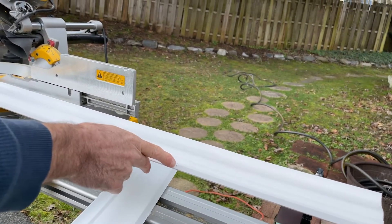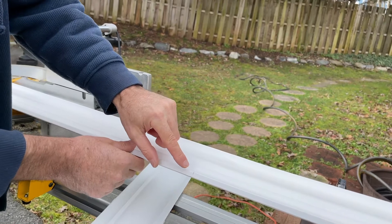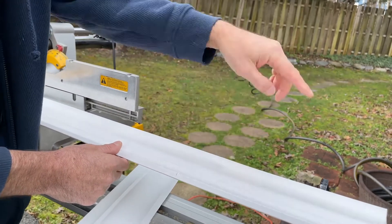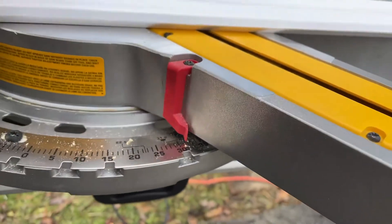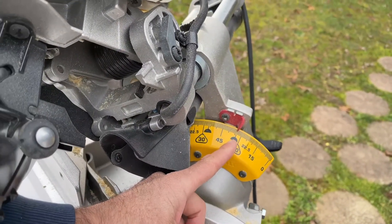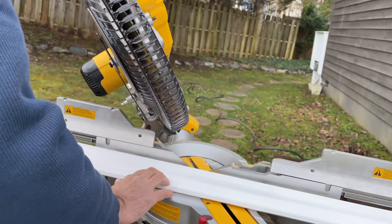The piece was exactly 15 feet — I've got my mark here. This is going to be an inside corner angle, starting at the bottom and going this direction. For an outside corner it goes the other way. Now I'm going to show you two different ways of cutting crown on your saw. You can set the table — it's got a mark for 31.6 degrees on the miter. Over here you'll have one that angles both ways; there's a crown mark at 34 degrees on the bevel. So you can set it that way, put the crown in flat, and cut it at the 15-foot mark.